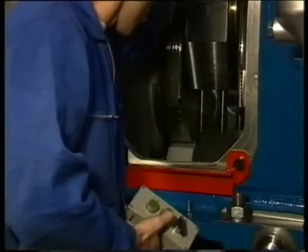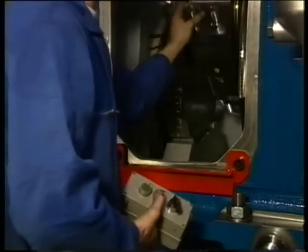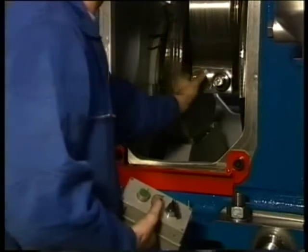Remove the jacks and turn the relevant crank to the top dead centre position. When turning, be sure that the bolts of the bearing block point downward to prevent them from getting stuck in the engine block.